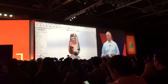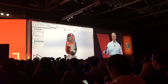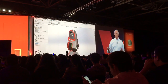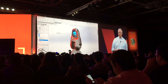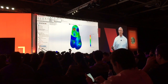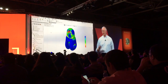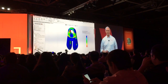Next, we ask you to run a simulation — a very simple simulation. We want you to fix those bottom two holes. I'm running SolidWorks Simulation here instead of Simulation Express, and since SolidWorks Simulation allows me to simulate multiple bodies inside a single part, I'm going to exclude those first two bodies. We'll add our constraint to the two holes at the bottom, then apply our load — I use my sketch to define the vertical direction, 5,000 newtons — and then we run it. In no time at all it comes back and gives me my results. I like to animate it because it helps me understand that this is behaving as I would expect. And in this case it does. The factor of safety is a little over five — that's what we have for Model Mania 2016.